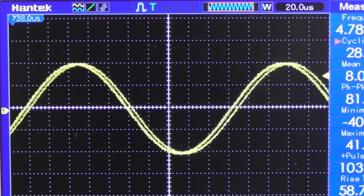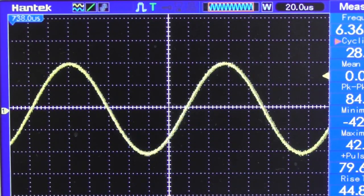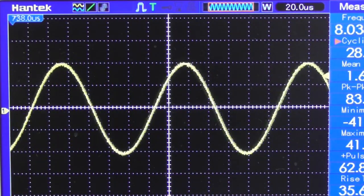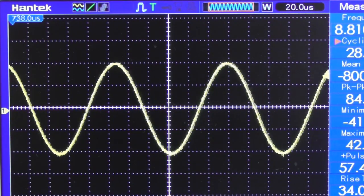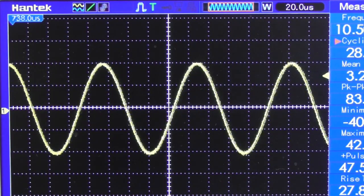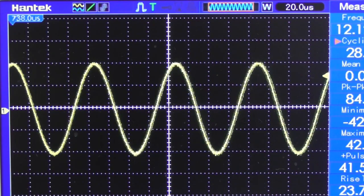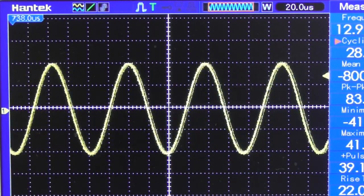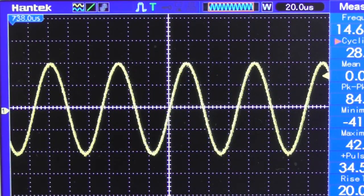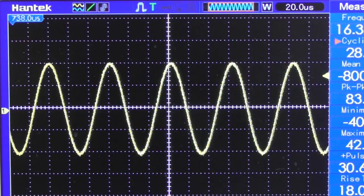I've also mentioned before that on this scope the lowest distortion you can really measure is about 0.5%, and it's mainly because the scope is low cost, because I'm poor. But there are no artifacts on it at all. I mean, you just cannot see any distortion. So all I can say is, this chip has inherently a very low distortion, if you care to look up the manufacturer's rating.